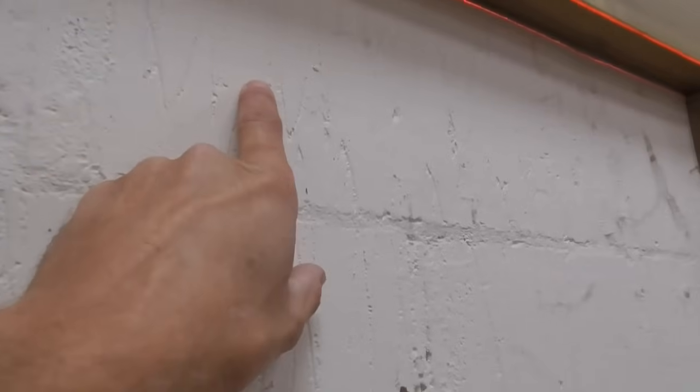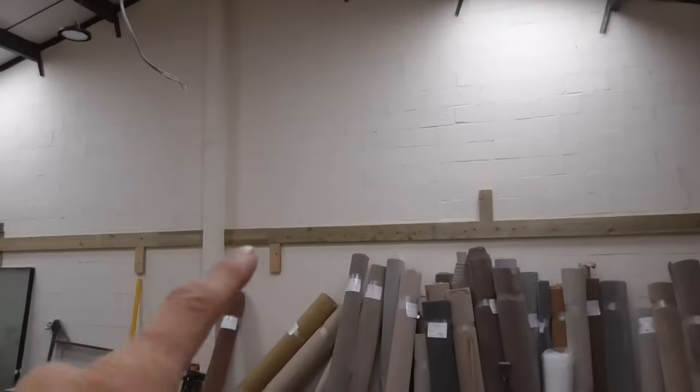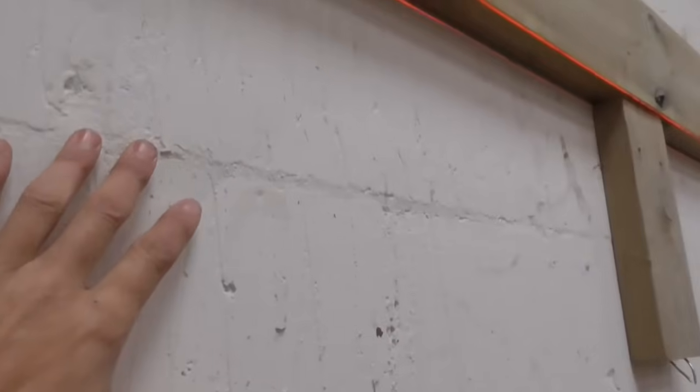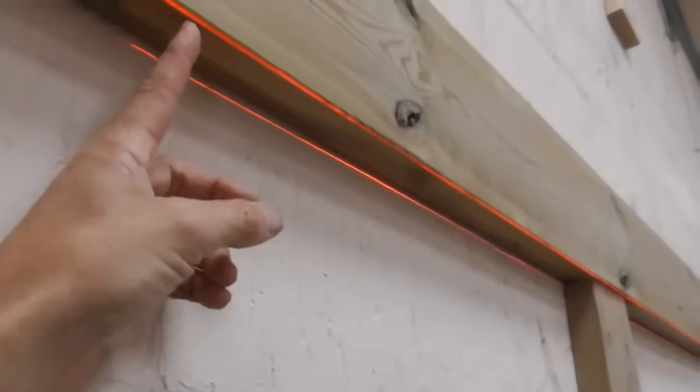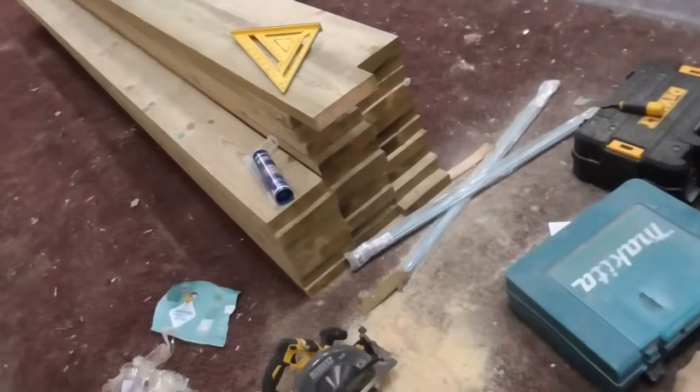We're going to go about 80 mil into the wall because I don't want to penetrate the wall on this side. I think that side is the party wall to the next unit, and I think they're 6-inch blocks, but either way, we'll go about 80 mil into the blockwork. And then there's 50 mil or 45 mil for the timber, and then we'll stick 10 mil out. So we'll get that measurement, get the disc cutter out, cut a load of these bars up.